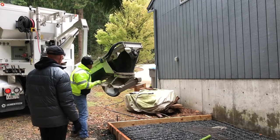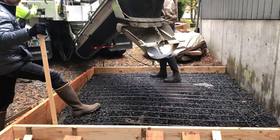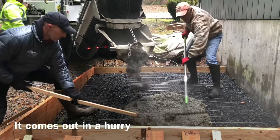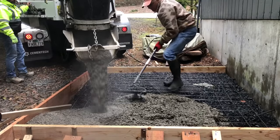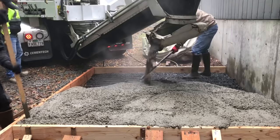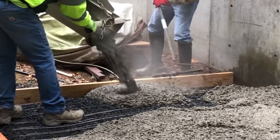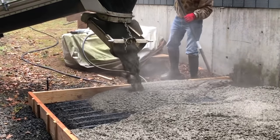A top tip: if you need a small or large concrete slab, check out a mini mix or on-site concrete company. They come to your house with a concrete truck and only mix up exactly what you need — you only pay for what you use. I only needed about a yard and a half and ended up using 1.6 yards, costing around $330. Way better than mixing an estimated 60 to 80 bags by hand, which was never a viable option.